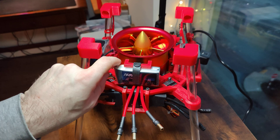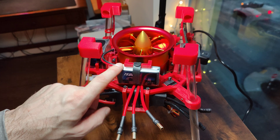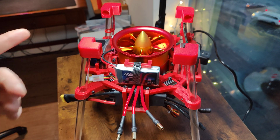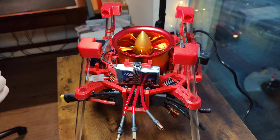Starting with this, it is a 1500 milliamp hour 2S battery. This is just powering the four servos that will have the control vanes for the EDF. The servos run on 8.4 volts — they're high voltage, high torque servos. I have on the other side a buck converter to pull that down to 5 volts for the circuitry.